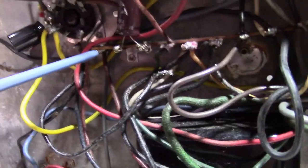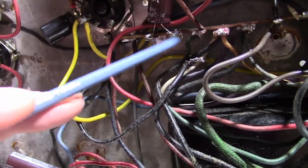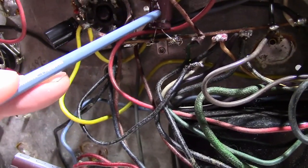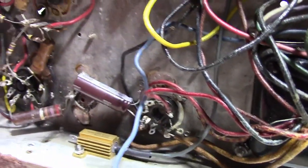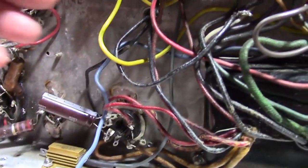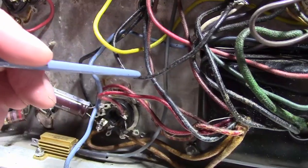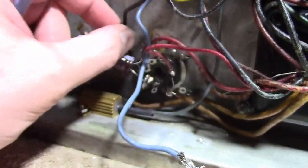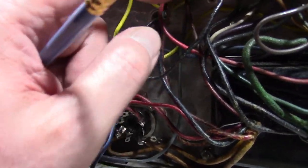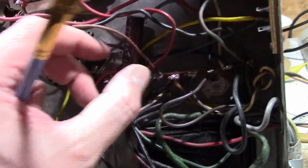But while doing so, I noticed that this lug is unused. And in between, this one is ground, and then here is this other 47 microfarad, identical to this one. So I'm thinking, instead of having this cap flop around a little bit loose, I'll put it up here. So these two black wires are the filter choke on the main B plus power supply. One of the wires goes there. I'll move the other one from down here over to there and put the two caps next to each other. So in other words, the main B plus power supply filtering stuff will all be localized right there.